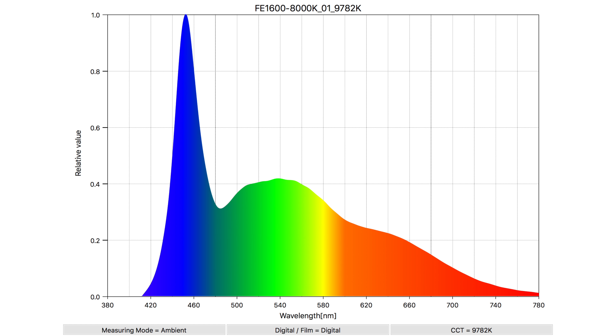When you get to other types of technologies for producing light, like LED, things get different. The spectral response of most LED lights tends to have more spikes and valleys, and in addition to that, it doesn't cover the entire spectrum. As a result, engineers have spent a lot of time working on LED lights to make them closer to daylight or tungsten, which is why they're still somewhat expensive, although prices have come down quite a lot in the last couple of years.